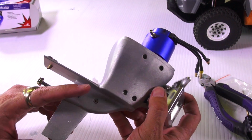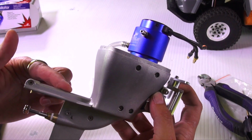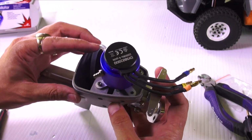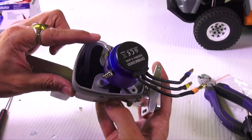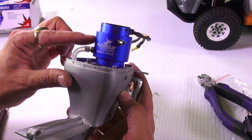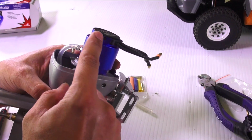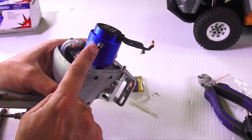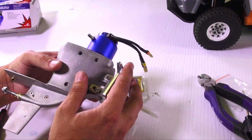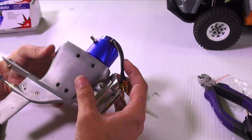As this outboard motor goes through the water, it'll be picking up water through the inlet tube here, carrying it along the spine up through what looks to be a small brass tube. And then of course I put this rubber tubing as an extension to the water jacket. All this water being forced into the jacket takes the heat of the motor and expels it through another tube right here, which will just spit out the back of the motor wherever I put the outlet tube. So that's how that motor is staying nice and cool.